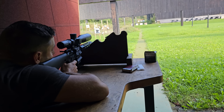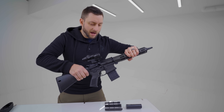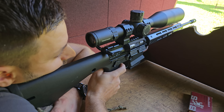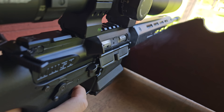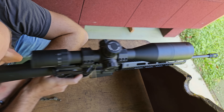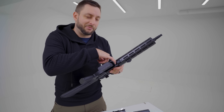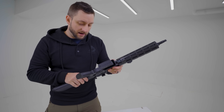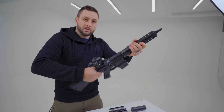The other thing that really bothered me was that this WWSD rifle, the European version, had some play between the upper and lower, so you could move them a bit. Now, this functionally does not make any difference — it doesn't influence the accuracy or reliability — it just got on my nerves. I want to have my guns really sturdy and solid. What I had to do is essentially take some brass. This is actually a hammered down 308 brass that I made into a shim. And I shimmed it here and in the back — you cannot see it there — and that made it super tight.